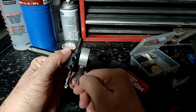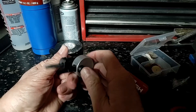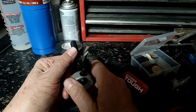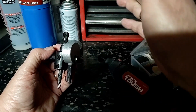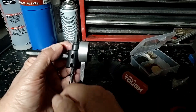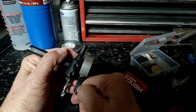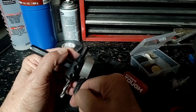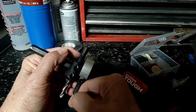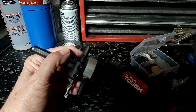Right now we're going to grind out a new tool bit for this thing, because as you can see it's not even on axis — it just doesn't cut. It's back scraping and it just doesn't work. I'm not going to have you sit here and watch me grind that out: it's going to take a long time, I need to see better, and you don't want to listen to grinding for 20 minutes. I'll bring you back as soon as I get this roughed out and may show you a couple of steps. See you in a few.